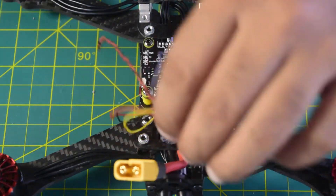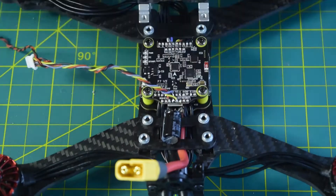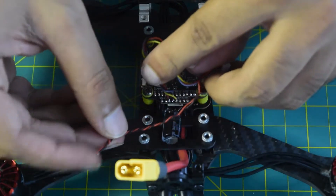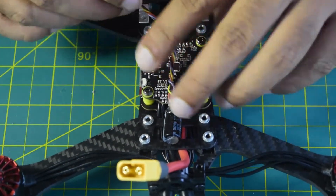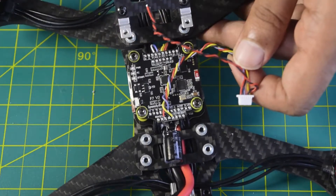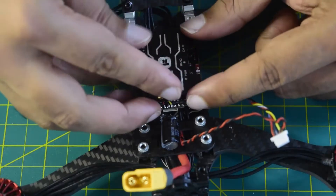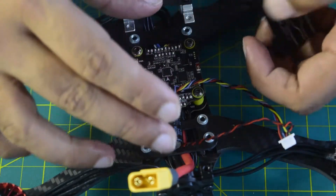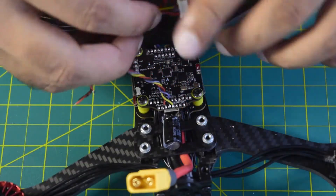Now that I have successfully connected all the wires, let's quickly twist them so that they stay together and do not mess up with other wiring in the future. I have kept another pair of black and red wire spare so as to be able to power another peripheral right from the VTX. Now let's push this JST onto the back side using the space on the front side of the drone frame, as I am going to install the VTX onto the back because on the top of the stack it cannot accommodate due to the thickness of this VTX and its heat sink.